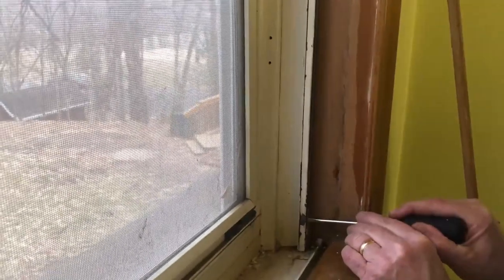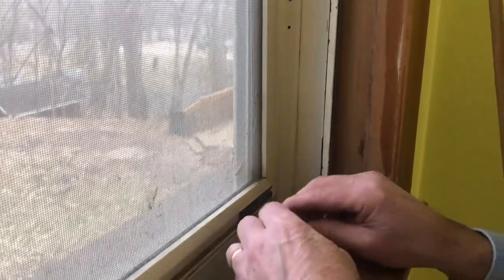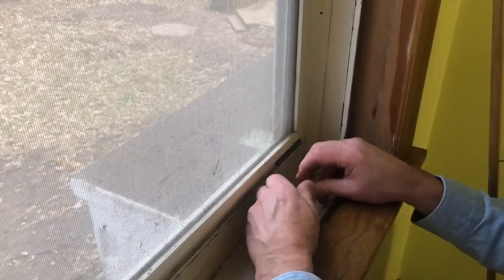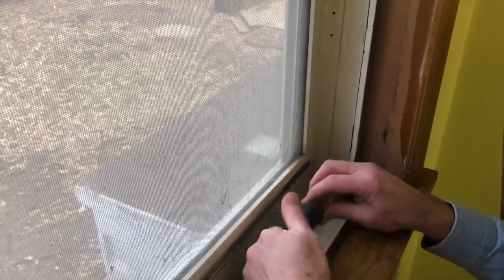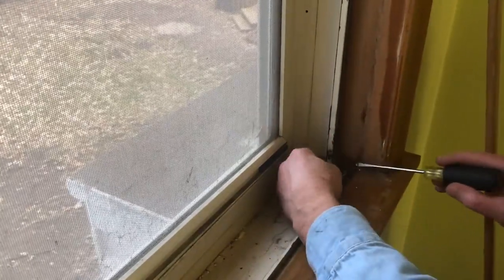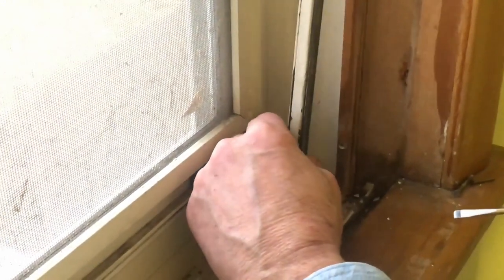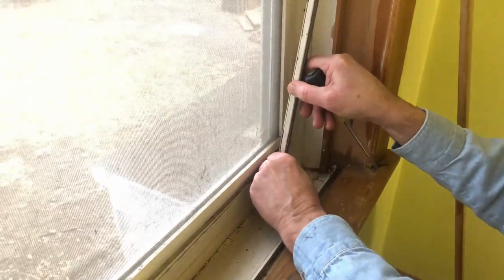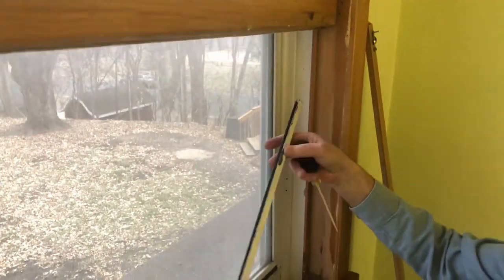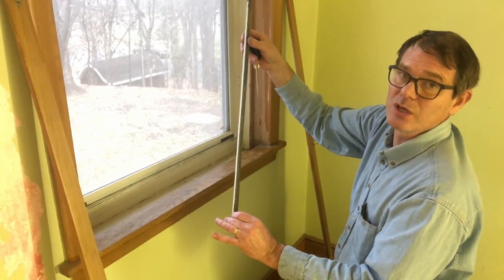If you notice right here, it's about an inch and a half above the bottom of the width of the sill — there's actually a screw. We're going to take that screw out on both sides. It's sort of a long, skinny screw, about an inch and a half. Now we're going to put a screwdriver behind the parting strip and pry it out, pulling it down and towards the outside of the window to get a little bit of extra room. You can see how it's coming out. Notice that one side happened to be painted, the other side's not. We're going to do that on the other side as well.